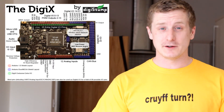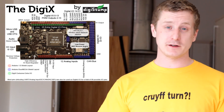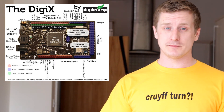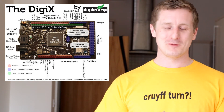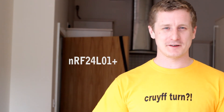It has two digital-to-analog converters on board and also an audio capability, and it can play audio directly from the onboard micro SD which is pretty awesome. Another great thing is it has an onboard NRF24L01 wireless transceiver, so you can connect to other devices with those transceivers, which is pretty awesome.